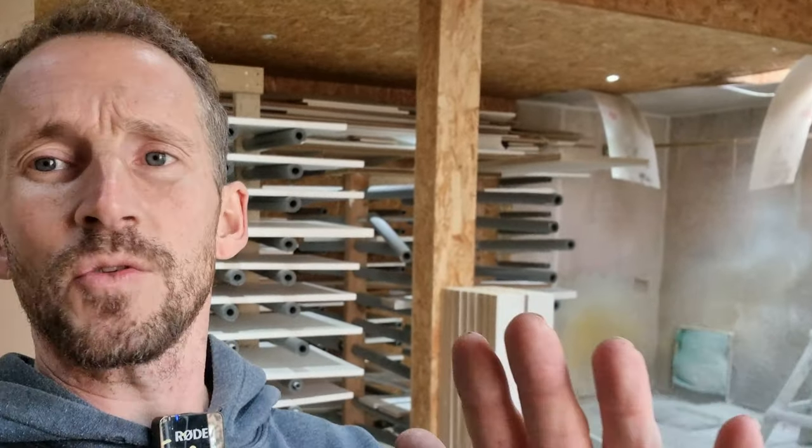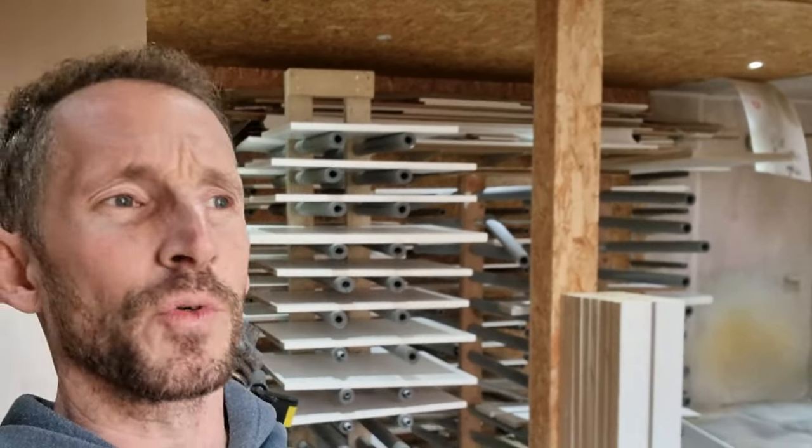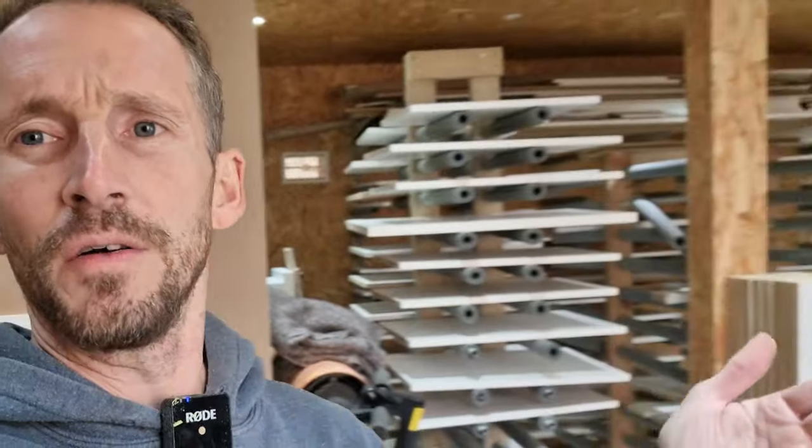Remember, we used a brand new cutter. It had never been used. Went really slowly with the router. Just not fast whatsoever. The slower you go, the better chance it's not going to fluff up on you. The router was at full speed. Yeah, we got really good results. So I will leave the video there.